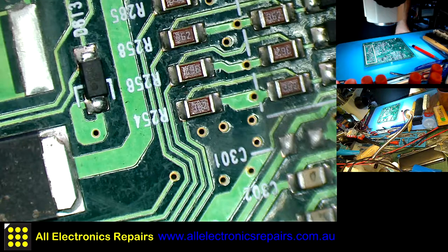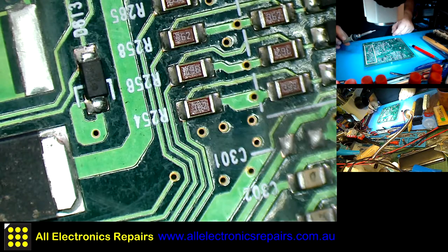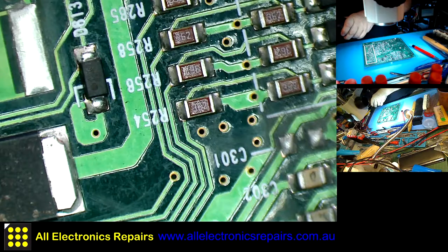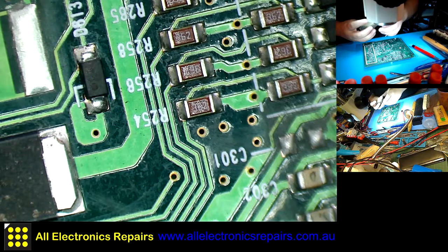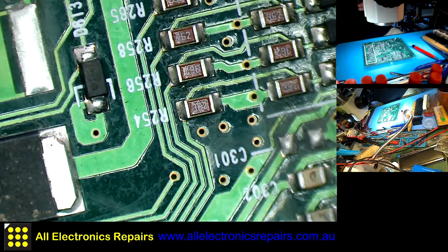For that reason I will use my different soldering iron, not the hook one, but one which is, I don't remember the number of it, but the one which looks like that, mostly because it has the flat area. So it is very good, well suited for soldering large exposed areas. I use a little bit of RA flux. For some reason that leaked, which is not good.